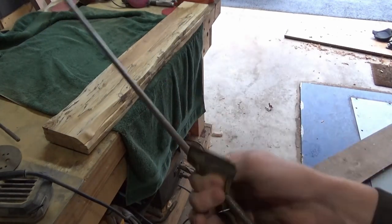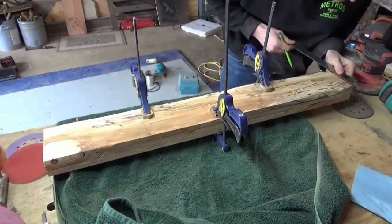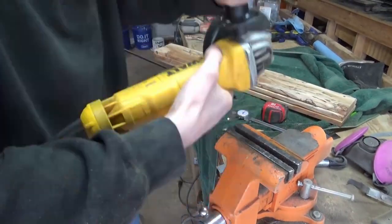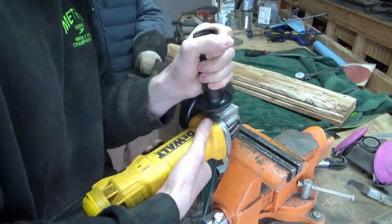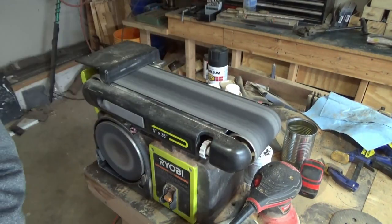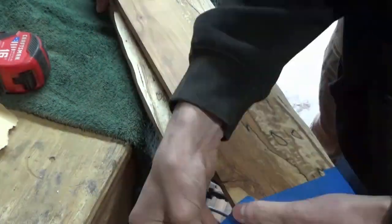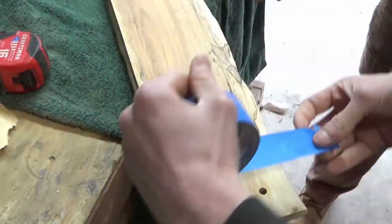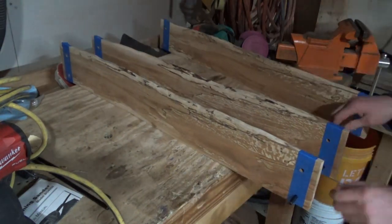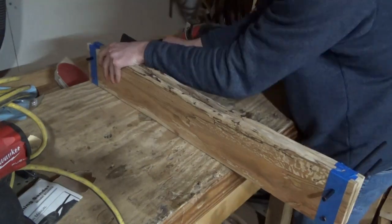I'm going to use two of these steel rods at either side of the shelf in order to hold the three shelves apart. I'm sanding them up and then drilling the holes, measuring them out with my calipers - although in the end I don't think I got these perfectly straight, but since I drilled through all three together it didn't really matter. I gave the rods a preliminary paint off camera and now I'm cutting them to length. Once I had all four rods cut I smoothed the edges on the belt sander, then moved on to putting masking tape around the holes in the pieces of wood. I had to make sure the shelves were in the same order as the way I drilled them, otherwise all four holes wouldn't necessarily align.